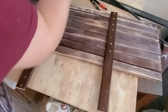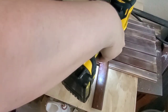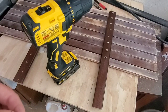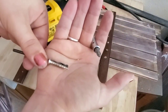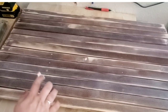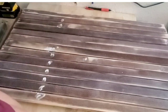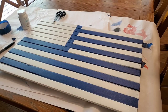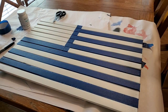I reline up my marker pieces, make a pilot hole, and drill through that brace piece — trying not to drill through the flat horizontal piece. After that I inserted one inch wood screws. I actually salvaged these screws from that crib as well, using a drill bit just a little bit smaller than the circumference of my screw. I put joint compound into some of those holes, once that's dry I sand them, and spray paint the whole thing with flat Rust-Oleum white spray paint. Then I marked off my blue square and all my white stripes, using the flag as my template.